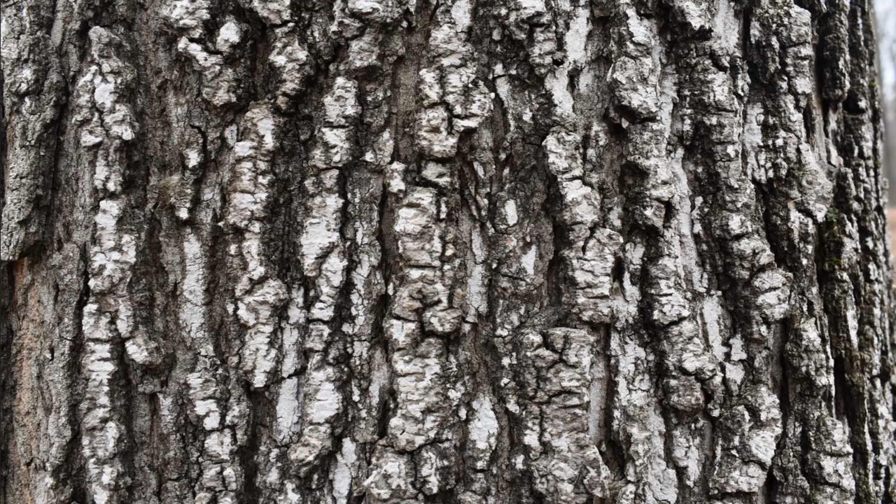Any questions? Anything below lateral, are you using check valves? No, not in every case. We've got 1,200 trees under research that we're not using check valves on, and that's a 3/16 to 5/16 comparison. I've got everything 3/16.